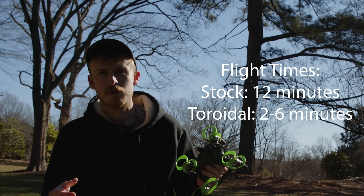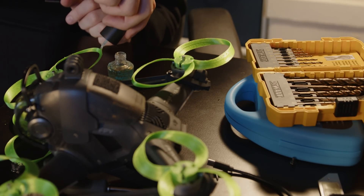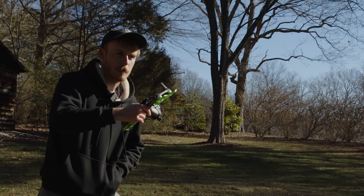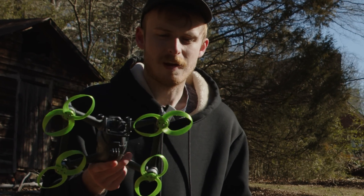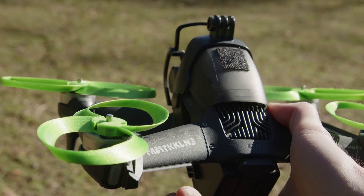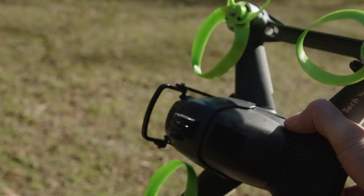The noise doesn't seem to cut it for the efficiency loss that I'm personally seeing. There's a lot of things you could attribute this to — mainly that it's a two-prop design even though the lifting surface is probably equivalent. With my testing, including a warm battery retest, I got similar results. This drone has a flight time of about 17 minutes with stock props, but you're only getting around seven minutes with these. Why would you trade 10 minutes of flight time for 10 percent less noise?